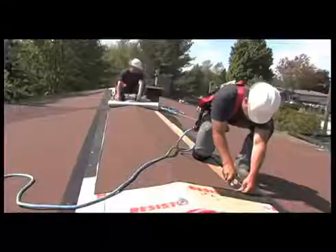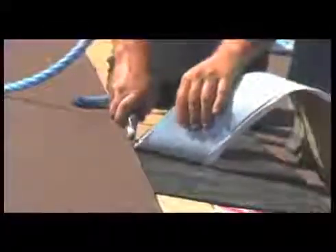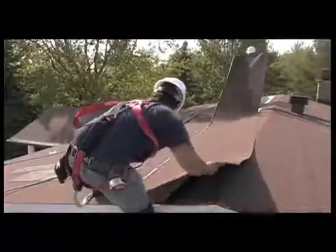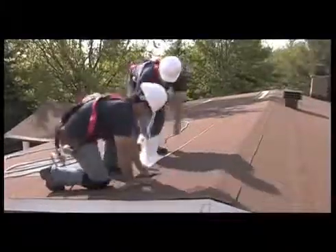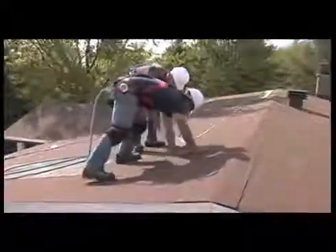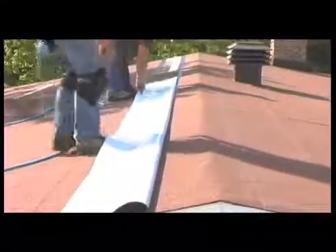The roof ridge can be treated in two ways. The first involves folding the last membrane length on one side over onto the other side of the roof, ensuring an overlap of no less than 8 inches. Do the same with the last membrane on the other side of the roof, folding it over. If the widths of the last membranes don't allow for enough overlap, use the other method: lay a 16-inch strip of membrane over the center of the ridge line to achieve an 8-inch overlap on both sides. As with the joins, the granulated part of the membrane that will be overlapped must be coated with elastomeric bitumen. Use a chalk line to show where you must not apply the bitumen.